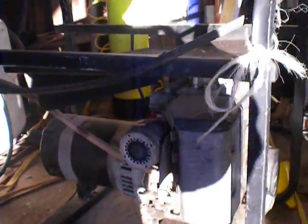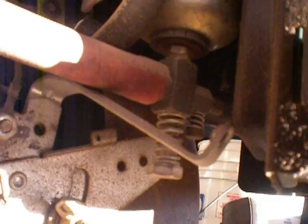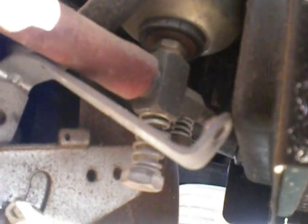What we got here is a propane-powered generator, just a common generator like you'd buy at Tractor Supply. That little valve there is what I bought, screwed right into the bottom of the float bowl. Just a needle valve is all it is, with a spud end. Line goes over here.